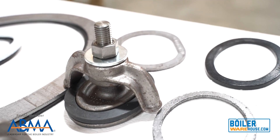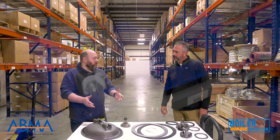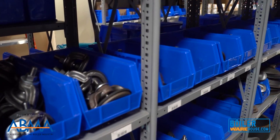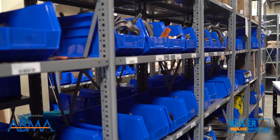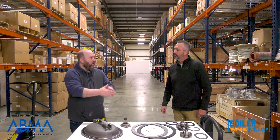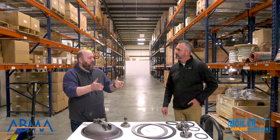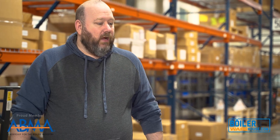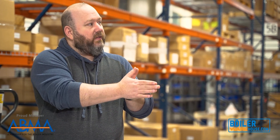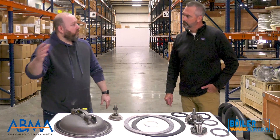Are they all the same? Depending on the boiler manufacturer's design, they may have different sizes depending on their position on the boiler. Like York, for example — they've got a front tube sheet, and some Johnstons do too. The handhold size in those is different from the rest of the handholds in other boilers. Also, the surface where it sits is flat against a tube sheet, while on the shell of the boiler the plates will be curved.